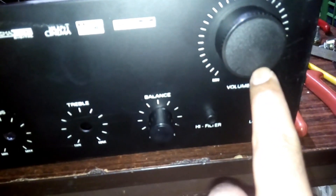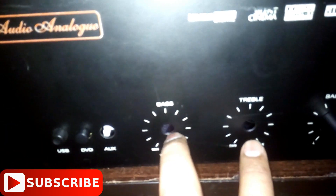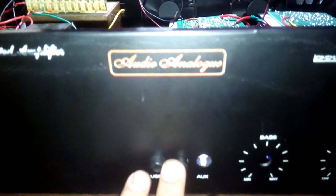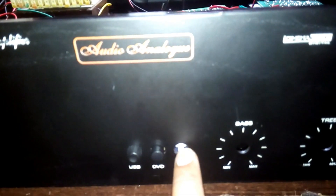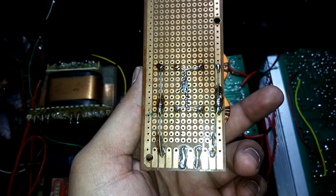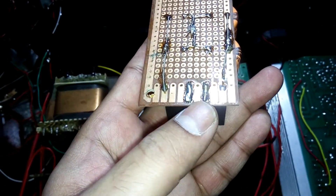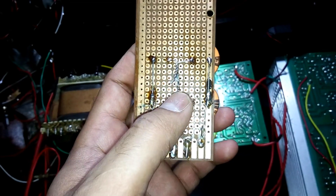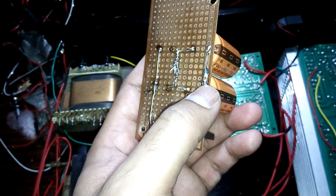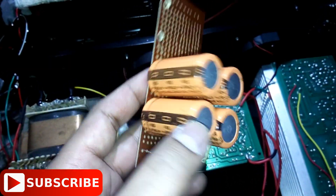Inside the front panel, two of the knobs are fake. The two potentiometers for channel A and channel B are fitted. I added two more capacitors to the rectifier kit as planned — you can see the connections. The AC input goes here, zero volt out, positive, and negative. More capacitors help when voltage drops, which is why I'm using four capacitors total.